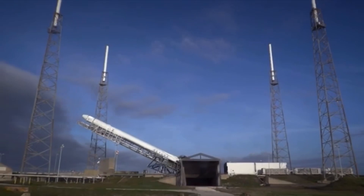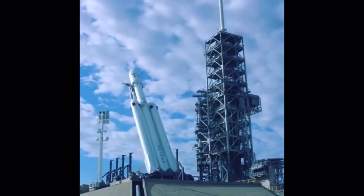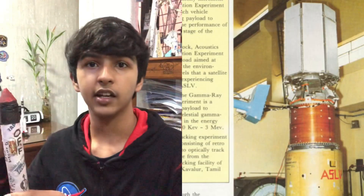The third and final difference between the ASLV and the SLV is the satellite integration system used to mate the satellite with the rocket. The SLV used the horizontal integration system, which many rockets in the world still use, like the Falcon 9. But the Falcon Heavy is being redesigned to be integrated vertically, like the ASLV. Vertical integration meant that the satellite could be put on the rocket while the rocket was still vertical, and the rocket and satellite could be mated while still on the launch pad. This also meant that the satellites could be made lighter because they only had to take the structural load of being vertical and not horizontal under Earth's gravity.